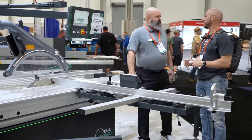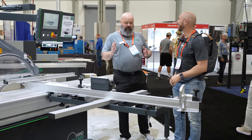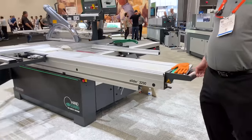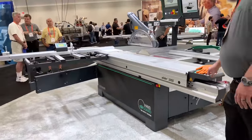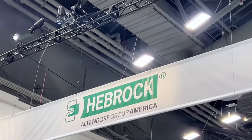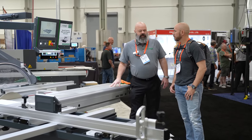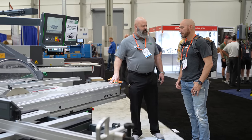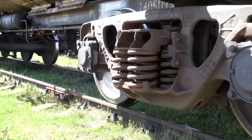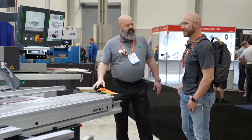So right now this is just industrial setting. Well, if you're a hobbyist and you got the money, by all means, I will ship it. But that's not the only interesting thing about this whole machine — the guide rail system and how well this is balanced. In all of our saws, Wilhelm Altendorf invented the sliding table saw. The progenitor of this company invented it about 118 years ago. The system underneath this sliding table is what sets us apart from everyone else. It's a double dumbbell roller system — if you think of a train and the wheels on a train, that's kind of what it looks like. Beefy, overkill. But this system will last 50 years.